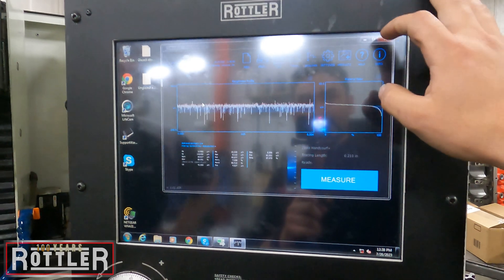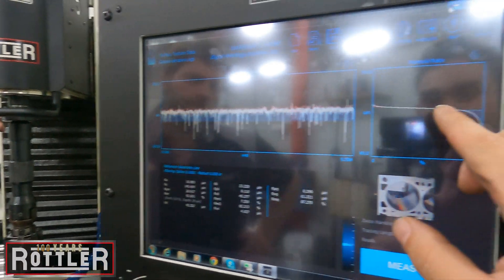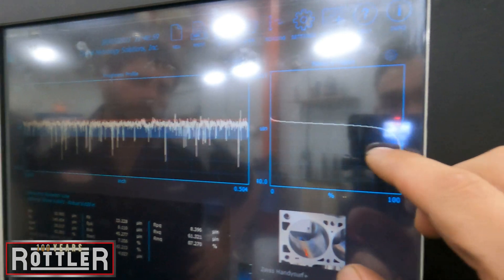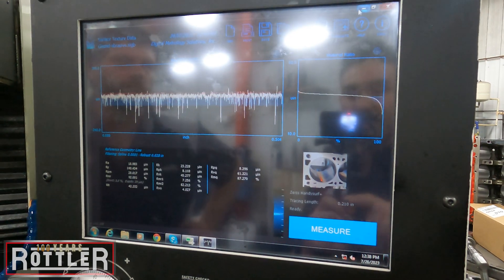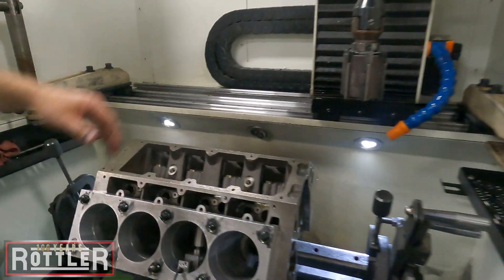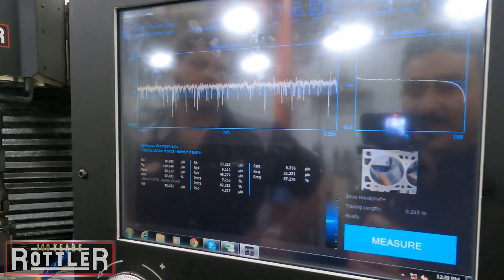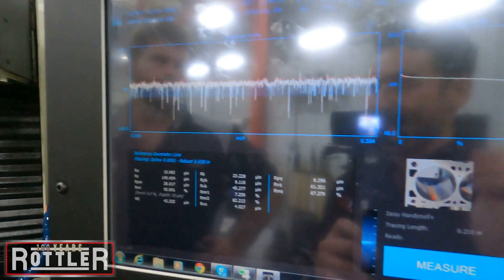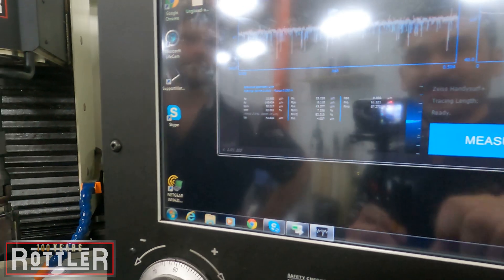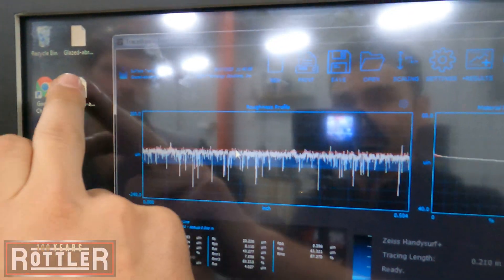That is pretty cool. This is the software on an H85AX — all integrated. Right after we've finished, this is what we're seeing, folks: we are seeing the material ratio curve over here, we have blue and red boxes, and these are transposed directly over to that roughness profile. We have all of our roughness information down here. Everything is completely — and you can control this, you're controlling the profilometer, that drive body. We've got it in the bore right now. You finish up honing, finish up running your software, and you're able to go directly in here, take a trace, look at all this information, print it to a printer, send that out to your customers, and you can also compare by just dragging and dropping and bringing in new profiles.